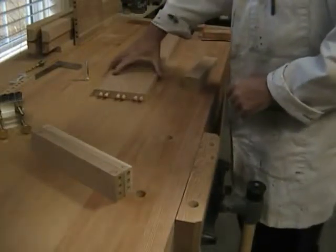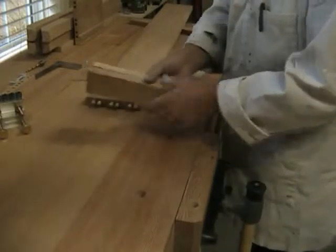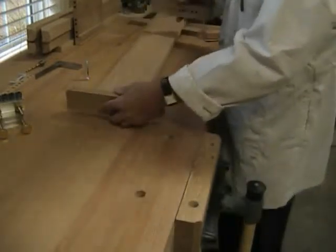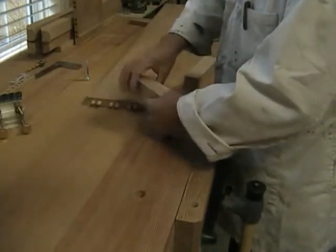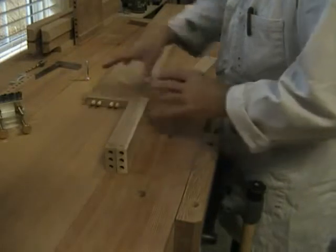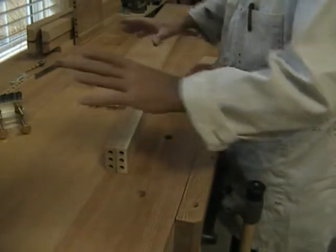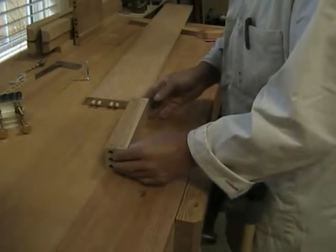The design of the table incorporates a lower longitudinal shelf which is attached to two transverse rails as shown. It is essential to make sure these rails are absolutely perfectly aligned with the longitudinal, or you'll get a certain racking when you attempt to join them.